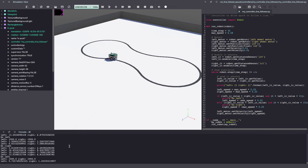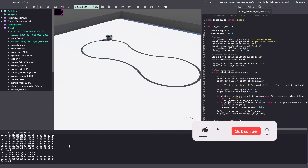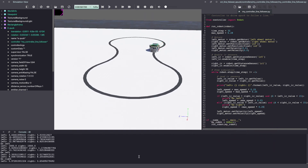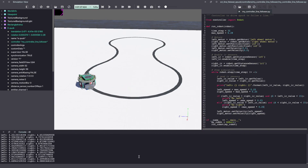The robot will continue to follow the track. In general, with a line following robot, you will have to tweak the reading values and the speed of your robot to ensure it follows the line. Any difference in the floor type, color and even lighting will affect the infrared readings, so make sure to adjust if there is a difference. Lastly, I'm cleaning up the code by removing any unnecessary print statements and adding comments for better readability. I hope you enjoyed this video — if you did, make sure to give it a like. If you have any questions or doubts, use the comment section below. If you want me to make more such videos or have specific requests, tell me in the comments. Don't forget to subscribe. Thank you for watching and I'll see you in the next video.